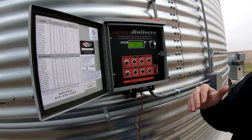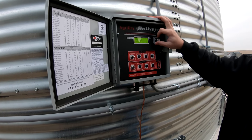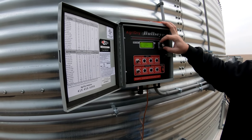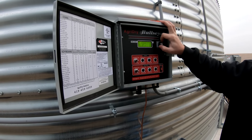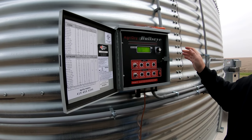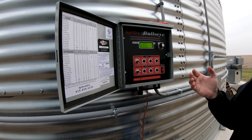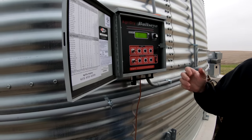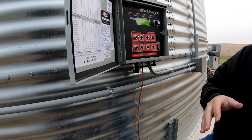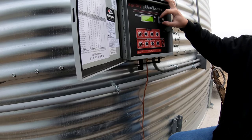We're going to tell it we're happy with the moisture in the bin — we don't want to gain or reduce moisture — but we're going to cool it off. To do that, we're going to tell it we're at 15 and set the target moisture at 15 also. That tells the controller we've got 15% grain and that's what we're shooting for. The plus/minus moisture is what you'll allow it to run in order to cool the grain down. Right now it says 0.5, so basically it'll run the fan from 14.5 to 15.5.